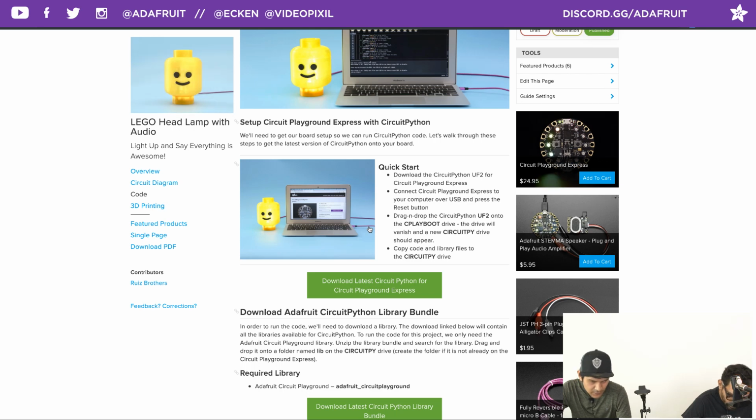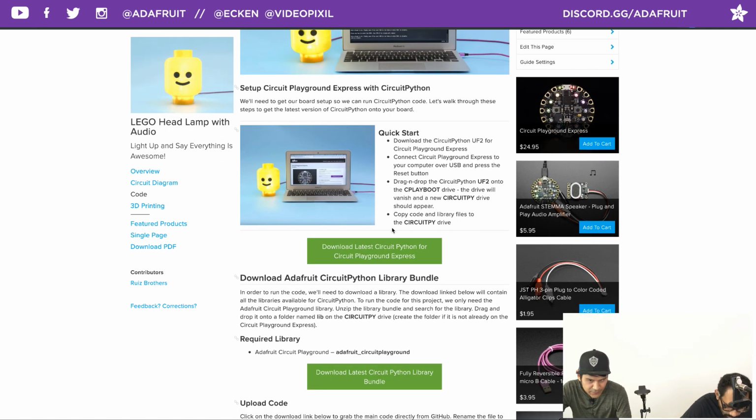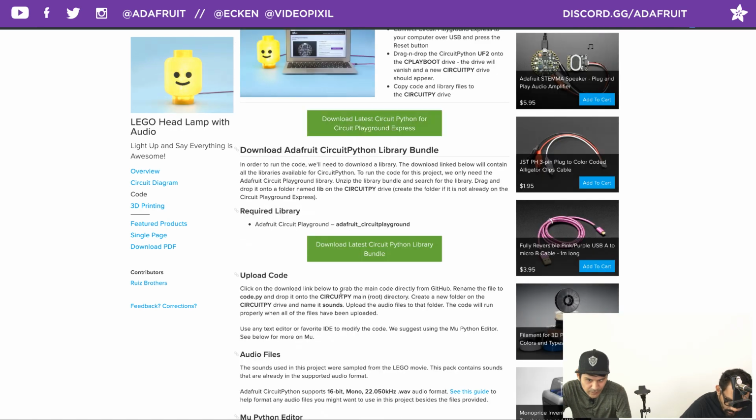It'll be called CPLAYBOOT. You can drop this UF2 file into that CPLAYBOOT to automatically flash the firmware with CircuitPython, so then it'll boot up with CircuitPython and rename the drive to CIRCUITPY, which will be the name of the USB drive. There's where you can add your libraries and your code and your sound assets. So download the latest CircuitPython for Circuit Playground Express. That's what this link will do. You want to download the library bundle. We're only using one library. The Adafruit Circuit Playground library is really nice.